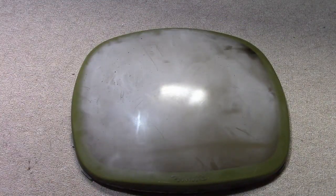Here's an example of one I picked up recently that I want to clean. They get cloudy over time, and they smell over time. Why? Because of the material they're made out of — a type of plastic called butyrate, also known as tenite. It's made out of cellulose and some chemicals, and it decomposes over time. It's the same stuff they make screwdriver handles out of. You may have opened up a toolbox that's been sealed for a long time and gotten a vomit smell. Same deal.